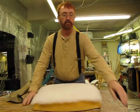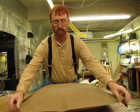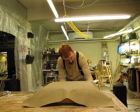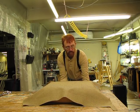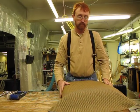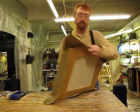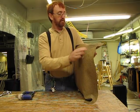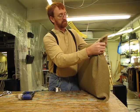Start with the back of the seat away from you. If you have a pattern you need to match, always start on the front. Tack it in the middle — about four or five places — just to hold it while you work the back first. Same thing on the back: start in the middle.